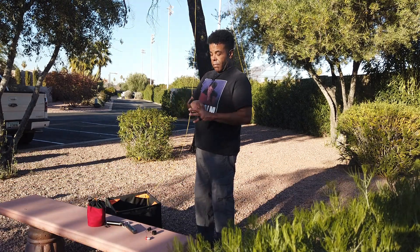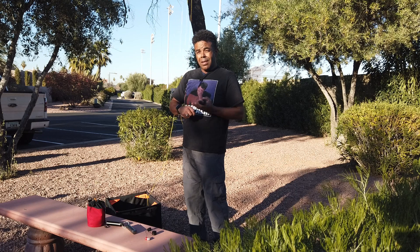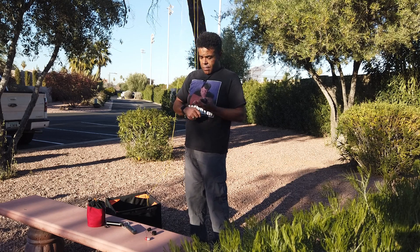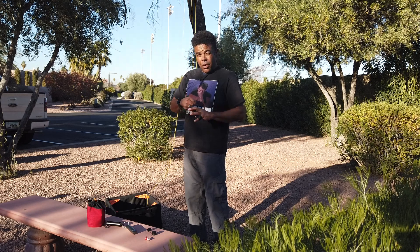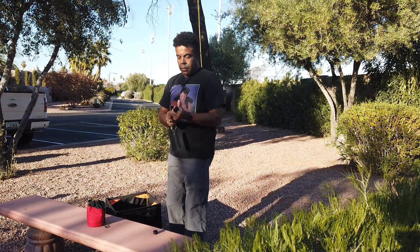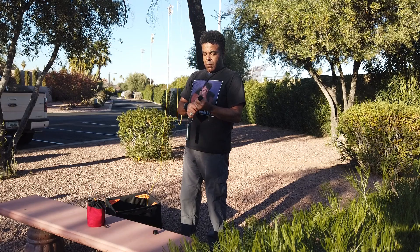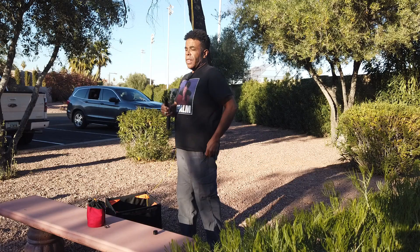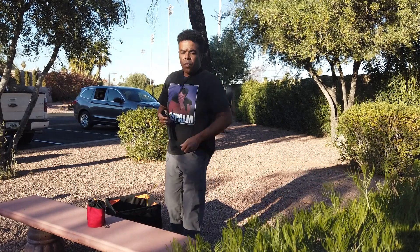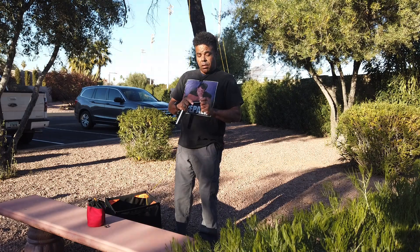There's my Amazon delivery. Either way it goes, I love Amazon. I don't want to speak out of turn, but I love this number 26 wire — especially when you're winding in a figure eight pattern, it tends not to tangle. Specifically, that's the number 26 poly wire. You can find that at the ham radio outlet. With that number 26 wire, the whole 40-20-10 antenna with the winding coil fit nicely right into this oversized pill container — two workable end-fed half waves in the palm of my hand.